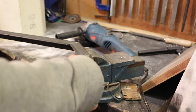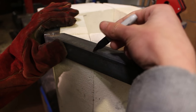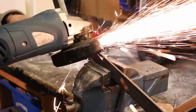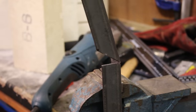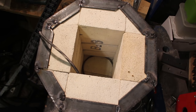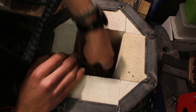Once at the right angle I welded it using my cheap arc welder, creating a very strong 45-degree bend. I then put it on and mark where the next bend needs to be. The process is repeated all the way around until I get back to the start and join it together. Once all tack-welded it's in the right shape and holds the bricks firmly in place.